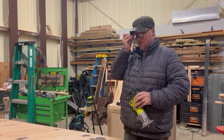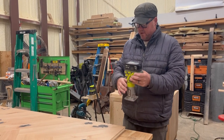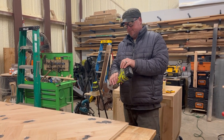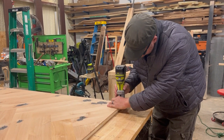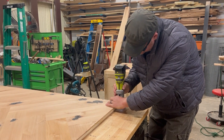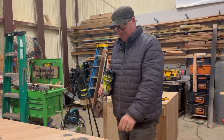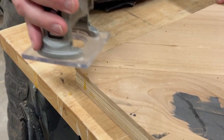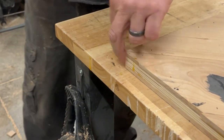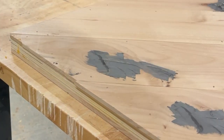I know my router spins this way, right hand, I'm going to go that direction. You notice how I went the opposite direction I said? It's just because I was trimming up this corner a little bit. I didn't want to snap this corner off, so I backtracked it a little bit. I do that on some of the joints and it keeps from catching that out.